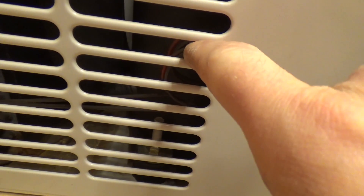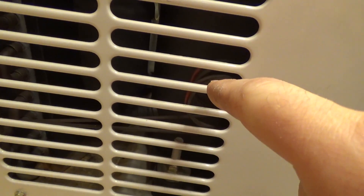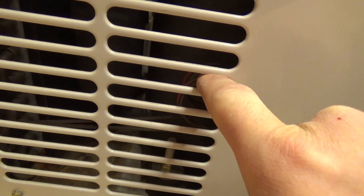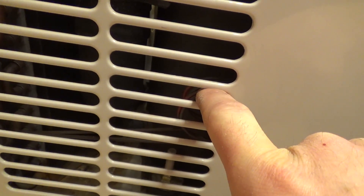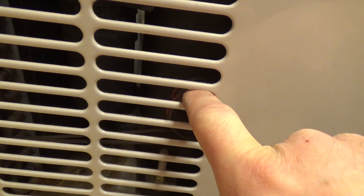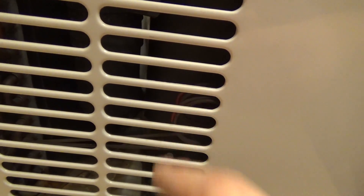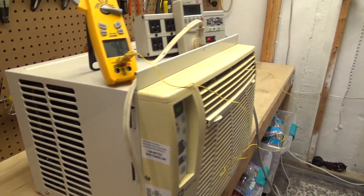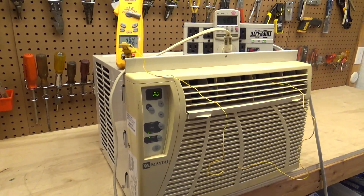The compressor sounds pretty copacetic. See these tubes right here — that quieted it down. That's actually very bad because the tubes can wear through each other and create a pinhole leak. We'll just take a tie wrap, stick it around there, and solve that problem. It won't happen in a 20-minute test, but that is something we have to correct before this goes into service.